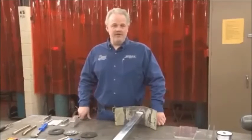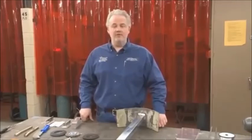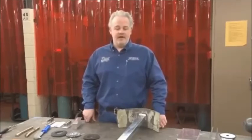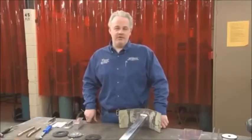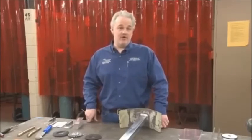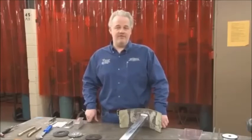When talking about aluminum welding, we need to separate it into two categories. One is aluminum fabrication — working with stock materials from a steel yard and building a project from the ground up. The other main category is maintenance welding or making repairs to aluminum pieces, and that's where things get more tricky. It's very important to know what type of base metal you're dealing with, because not all aluminums are weldable. Some cast aluminums are not weldable, and some higher series aluminums are not weldable without filler rod. Knowing which type of aluminum you have is very important.